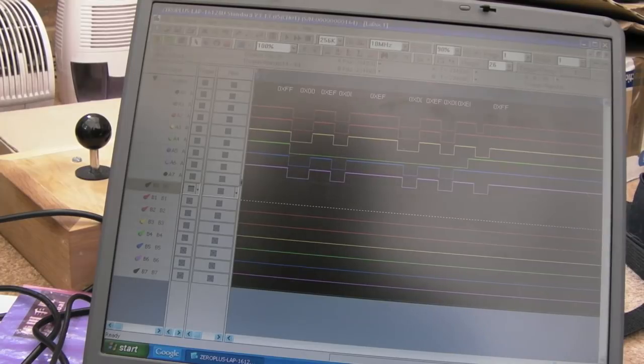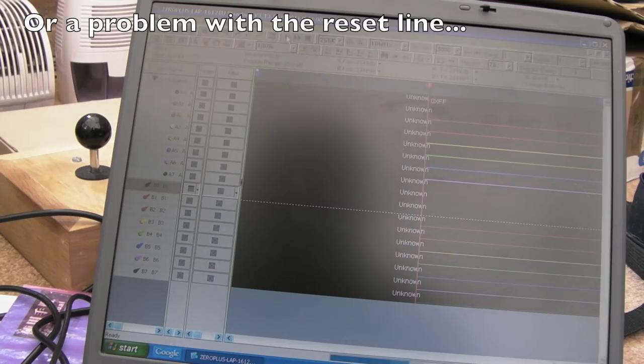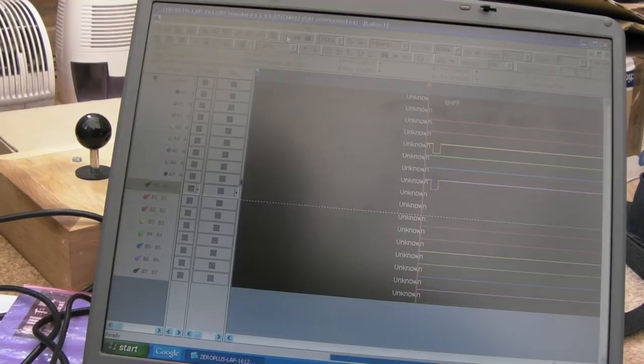The BBC is still on with the speaker disconnected. Clicking play — the trigger happens instantly. It's continuously resetting, which I'd expect if no program were running. There must be some sort of watchdog thing going on. With the different CPU we're not seeing stuck FFs — that's interesting. I wonder if there have been multiple faults and the CPU issue just wasn't noticed until now.